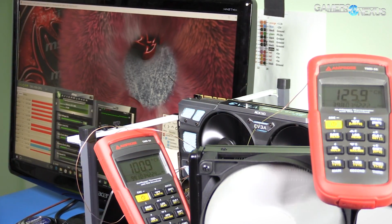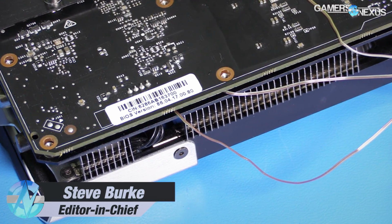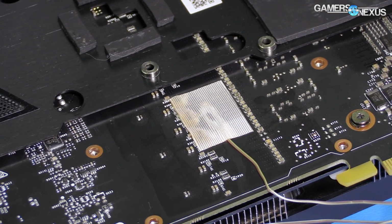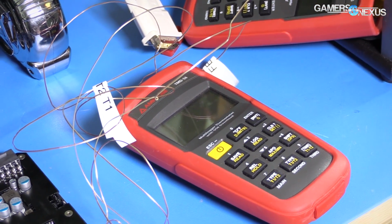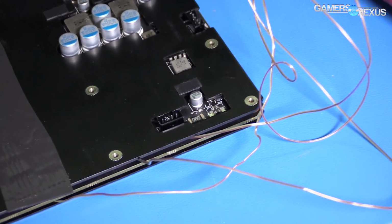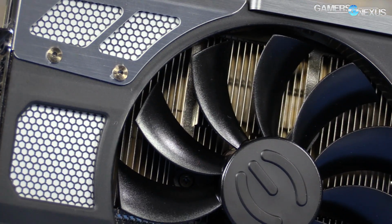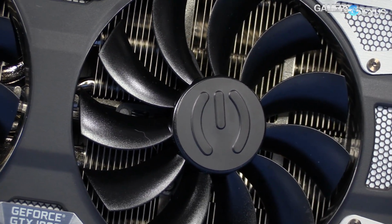This is the end-all be-all of content surrounding EVGA's VRM temperatures. We attach thermocouple probes directly to the PCB's backside hotspot to MOSFETs number 2 and 7, which are commonly shown scorched in photos of defective cards. And we ran dozens of tests ranging from optimistic use case scenarios to completely unrealistic torture tests. Testing was done with and without thermal pads, and also with and without the VBIOS update, and with a stock unmodified card as well. Today we're showing a closer look at EVGA's 10 series ACX 3.0 cooler thermal issues.